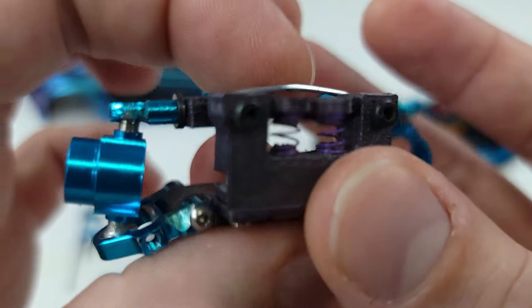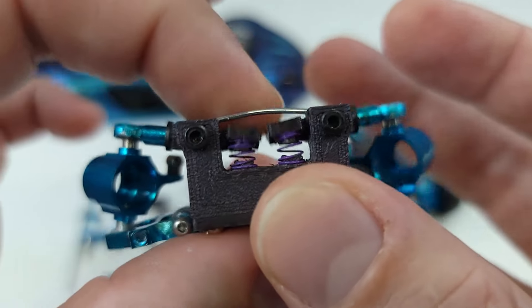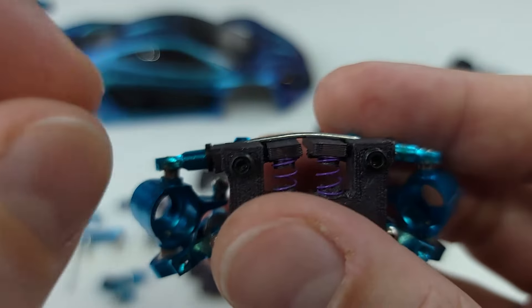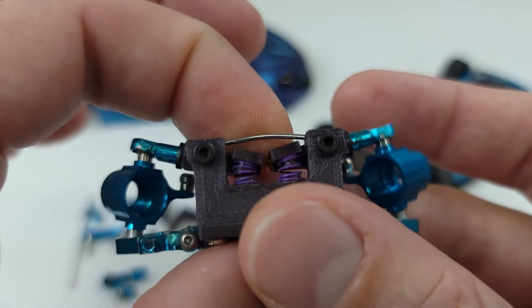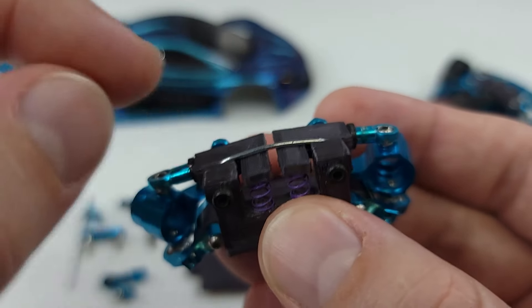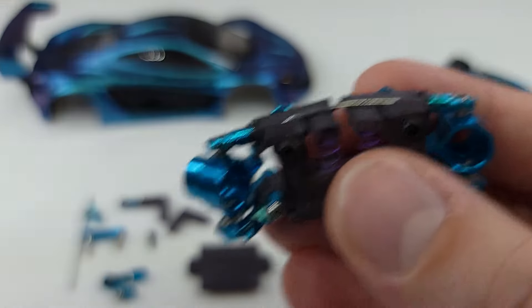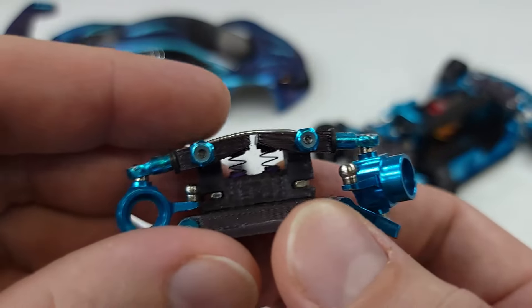You want to make sure there's no wobbling left and right or up and down. You want to make sure you just have it big enough to where the screw can get through but not too big where it has a lot of slop on it. You want to make sure it's tight, but also able to go up and down without getting stuck, because if it's too tight there'll be too much friction and these won't go down — they'll just get stuck. You can also add a little bit of lube in there too to help get rid of some of that friction. Remember, you can always take away material but you can never add material, so just take a little bit off at a time until it fits perfect.